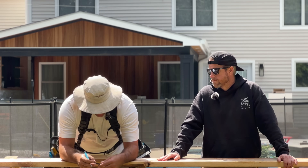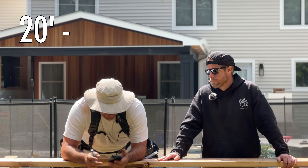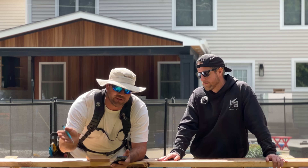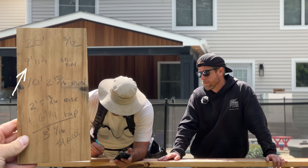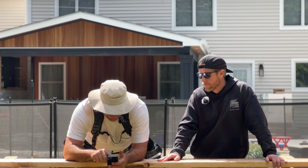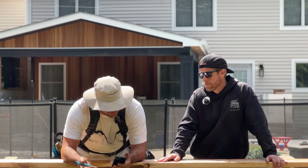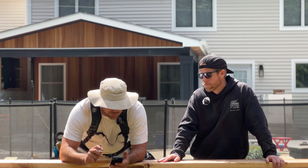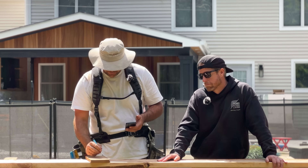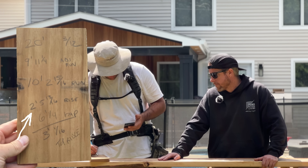I like to use a calculator — makes it a little easier. The first thing I'll do is put in 20 feet, my overall width, then subtract the thickness of my ridge, which is 1.5 inches for two-by material. That gives me 19 foot 10 and a half. Then I divide that by two because we're only dealing with half the roof, which gives me 9 foot 11 and a quarter — that's my adjusted run. Once you have that, hit the run button and it's stored. I know I'm dealing with a 3-pitch, so I hit three, then inch pitch — that's stored too. With those two numbers stored, just hit diagonal, and that gives you the measurement from the top plumb cut of the rafter to the outside wall plumb cut. It also gives you your rise, which is 2 foot 5 and 13/16ths.